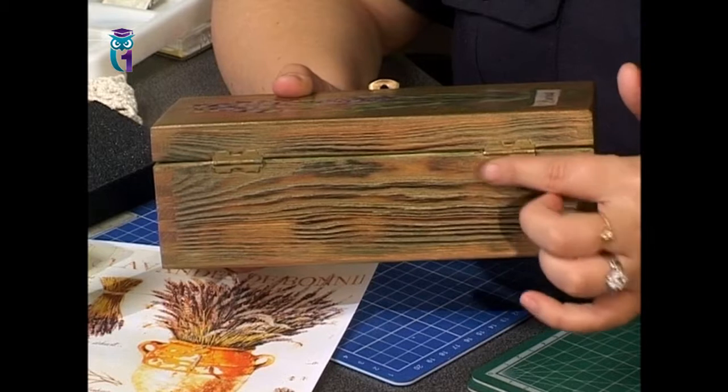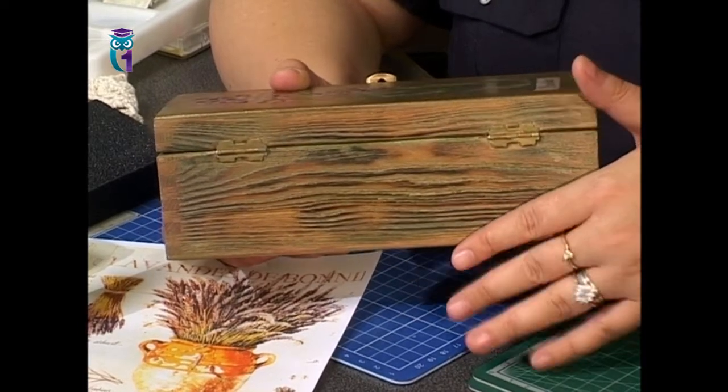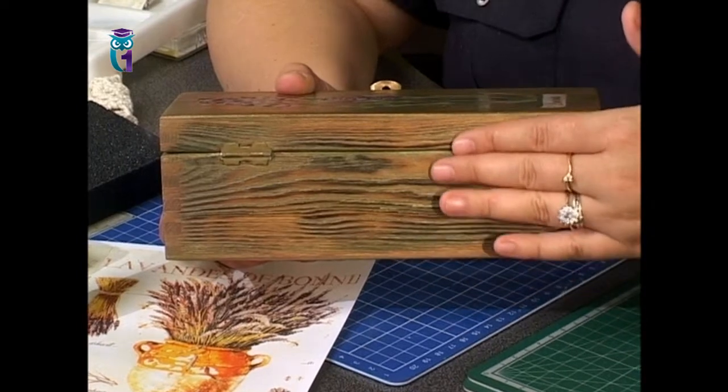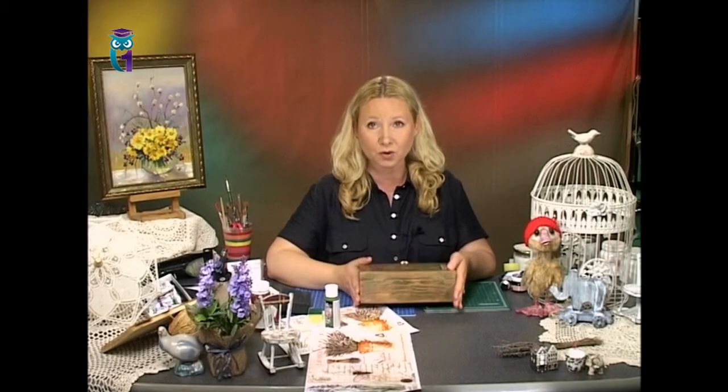I draw your attention to the fact that after you apply a color varnish, the wood structure on the product won't disappear, and on the contrary will look more contrasting, because soft fibers will be painted in light color and the rigid fibers burnt by a torch become darker. For the further toning, I suggest using green patina.